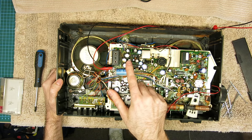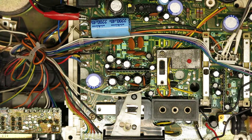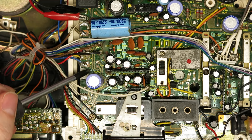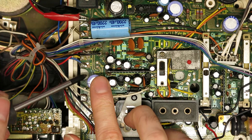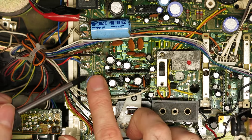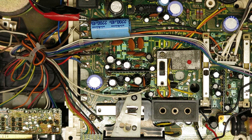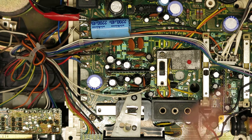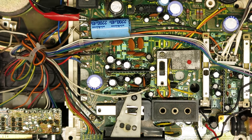Having a bit more of a look around this board, I can see corrosion on the traces next to this Panasonic capacitor — I've been told these ones with the purple jackets can be troublesome. There's definitely something going on here. It does feel like it could be a capacitor issue. I will give all the switches a clean just to isolate that as a potential cause, but that's not looking great.